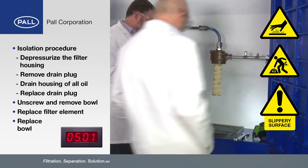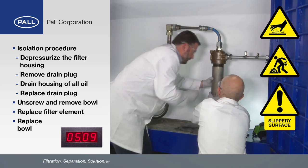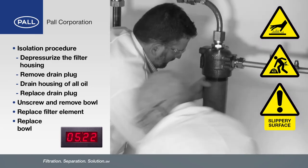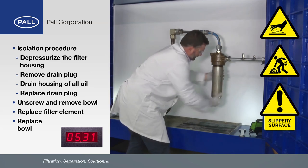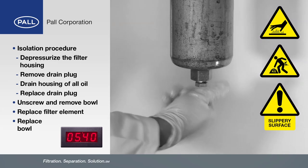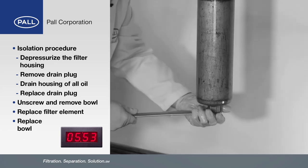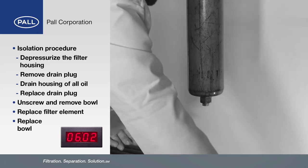Tony, can you give me a hand here please mate? If you can take the weight on that Tony, I'll try to get the thread in. I think we nearly got it Tony — thanks for your help. As we can see, it took two of us a couple of minutes to get it on; the bowl's quite heavy and I've got oil all over my hands, making it quite difficult to put back on. We get the correct spanner again and tighten up to the required torque setting which is in the service manual. That should about do it — and don't forget the drain plug.